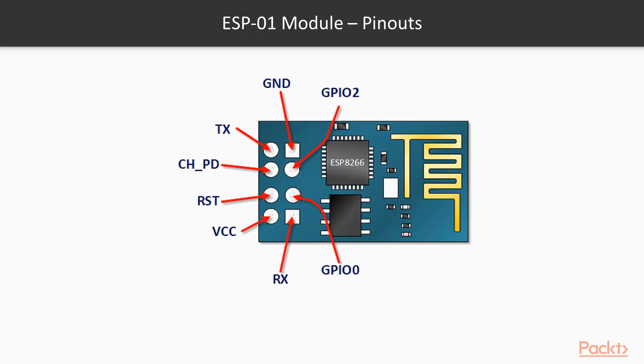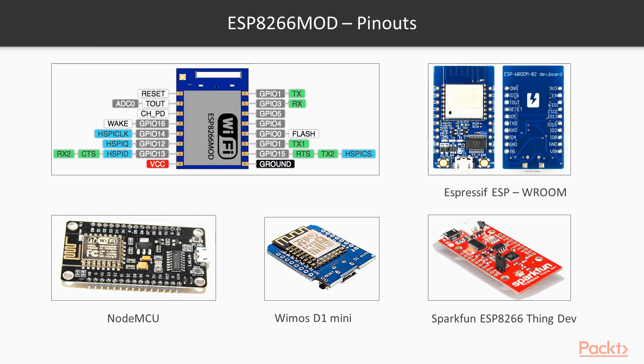Here is the diagram of the initial module of this chip, consisting of only two digital I/O pins and one UART to control the pin by AT commands. CHPD is the enable pin which is always kept connected with the VCC in order to operate. The other IC located right below the ESP8266 is the flash memory where the program is stored. And of course we have the reset pin, the VCC, and the ground pin. The modified version of the ESP8266 was released some time after, which had the capability of more GPIO pins and processing power.